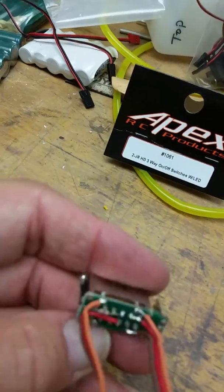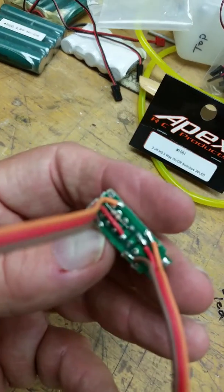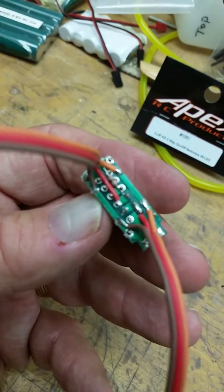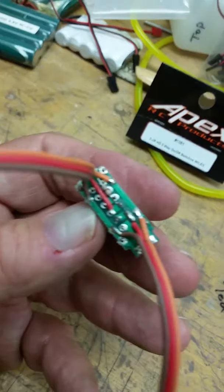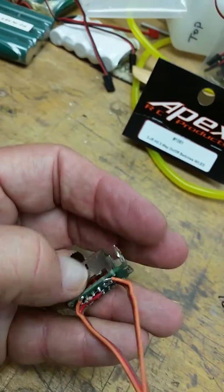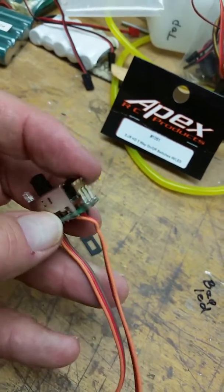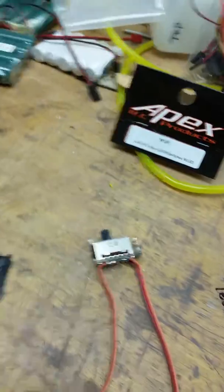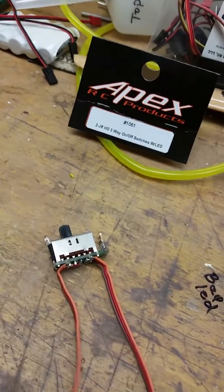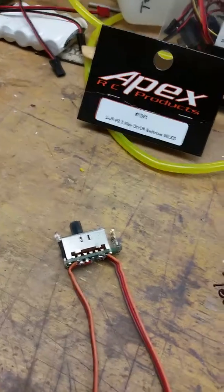So I'm going to cut these LEDs out. All there is is a little resistor on the back — very small — but I'll just nip that off with a set of close cutters, take that LED out of the circuit, and then I'll have a good switch. All the other solder lands seem pretty adequate. I haven't taken one clear apart to look at the contacts inside, but I'm going to assume they're gold-plated contacts, and these are gold-plated charge pins in there, which is good. So cheers to Apex RC's products — heavy wire, good connectors — but not real pleased with that LED stopping it from going all the way to the detent.